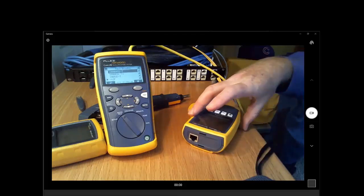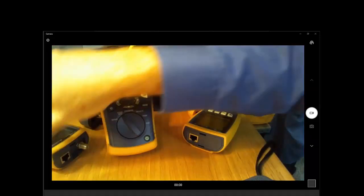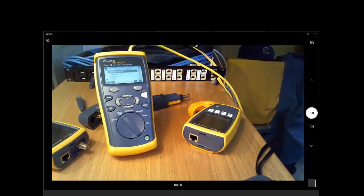Those aren't very common, but that is something I would be a little bit careful of. There is also a second element to that. If it is an IEEE device, as most people know, if you got a 24-port switch, the chances of being able to support the PoE power over 24 ports is very little. Typically you can't enable PoE.